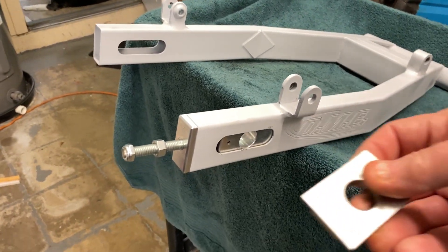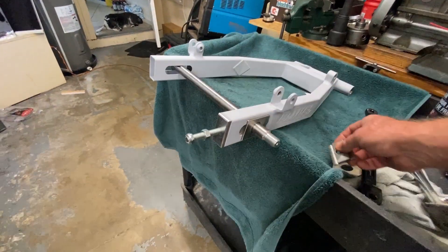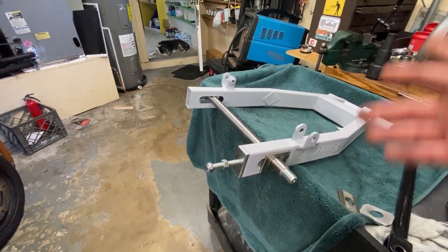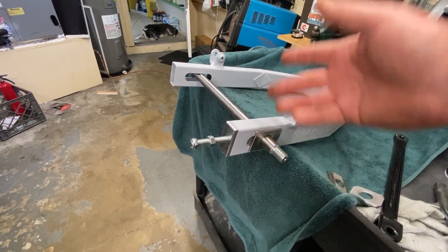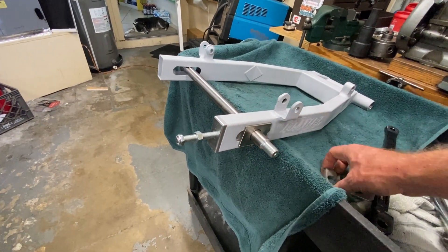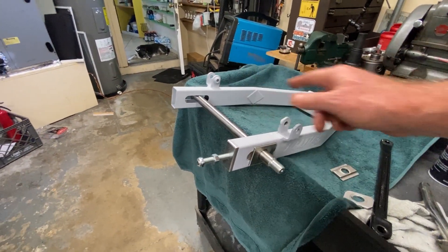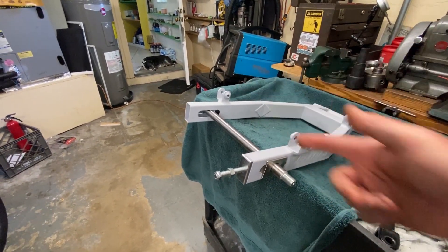That's where we're at on this, and I think it's going to work out great once I cut the radiuses in it. It'll go all the way up to the front and the back. What these pieces do is force that adjuster up to the inside wall of the swing arm tube — you can see it's right up against the inside wall right there. So when you have the axial load of this thing being torqued, 60, 70, 75 foot-pounds, without this it's going to crush this in a little bit. Assuming I can get this dialed in by facing it down maybe five or eight or ten thousandths with a fly cutter — that's why I left it a little proud, a little thick — they'll be touching this metal at the same time it touches the aluminum adjuster and pulls everything together. There'll be one on the other side, so nothing is going to crush. It's going to be a solid dead pull along the axial load the way it's supposed to.